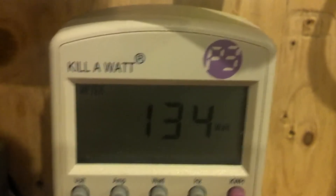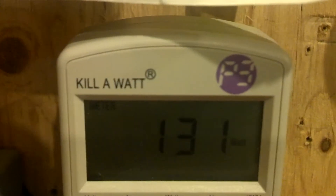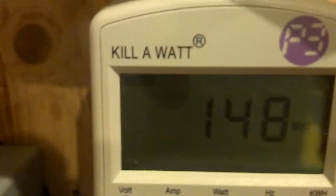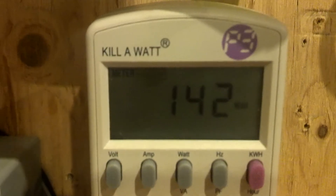Getting back to the main point of this update: at 2 o'clock in the afternoon Eastern Daylight Time, we just saw 152 watts. The sun's near its apex right now — it's not summertime yet and it's sitting dead center over these solar panels. This is what two panels on 40 feet of wire are putting out. Once I get them on the shed and cut that down to about 10 feet into the grid-tie inverter, I think we'll see a lot more output. I've also been hearing about putting one GTI per solar panel while running at 24 volts — I have them hooked up in 24-volt config because of the 24-volt GTIs I purchased for the wind turbine. Alright guys, I've got to get back to work — thanks for watching, remember solar!